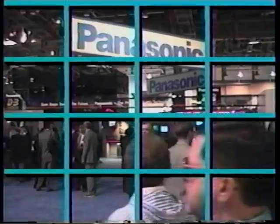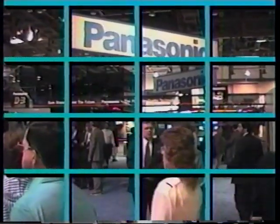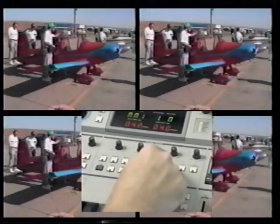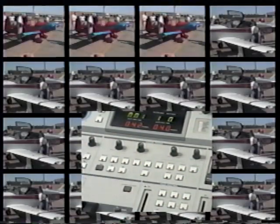Here's a simple little effect that gives the illusion of the video walls that you see at some trade shows where multiple TV monitors are stacked to produce one large TV screen. Send a video signal to the B bus and hit the multi-effect button 3 times to get a 16-picture multi and push the once button to freeze it.